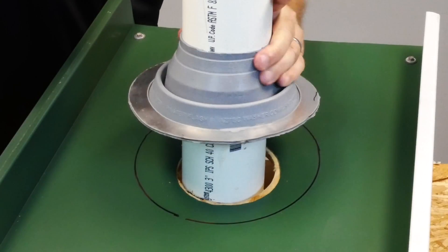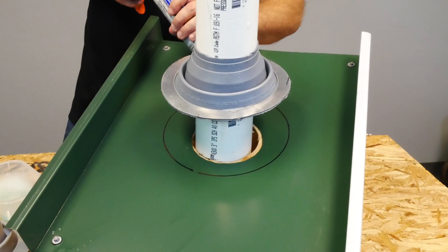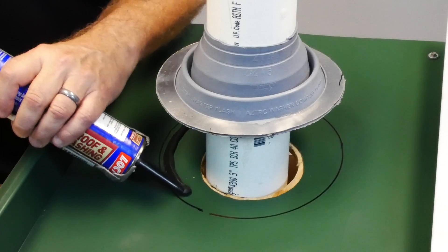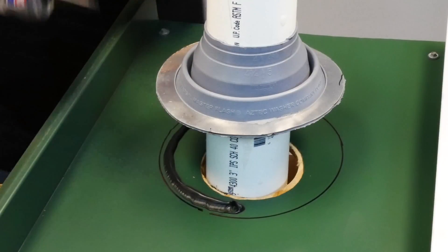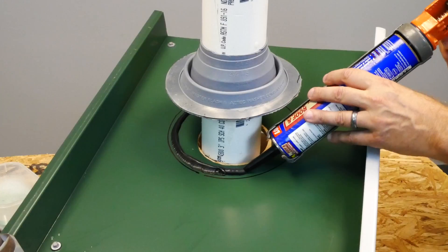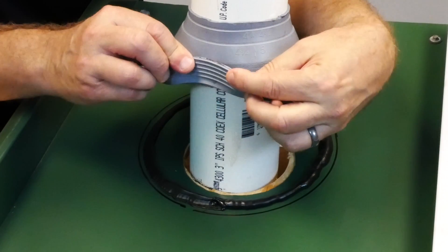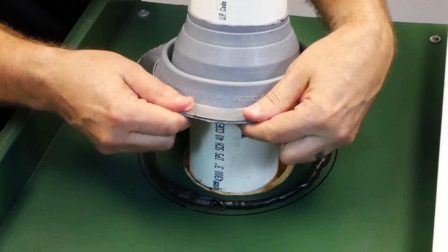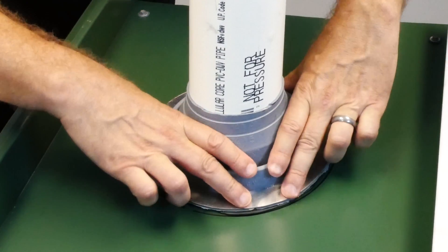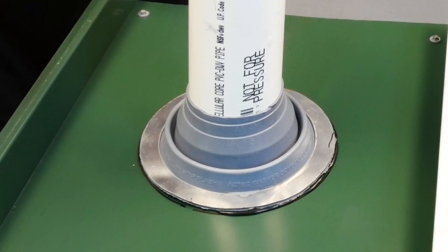One thing you want to do is try not to put too much sideways pressure on your vent pipe, because you can cause damage internally. Next we're going to run a bead of caulking just inside our line all the way around — make sure there are no gaps. You don't need a huge amount of caulking, just enough to bed it. When we press it back down, the grooves in the flange will help bed that caulking in place. So we just push it back down and bed it. Now we're ready to fasten it down.